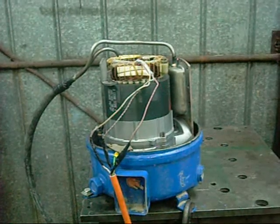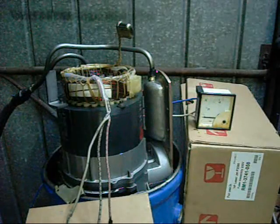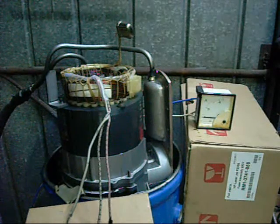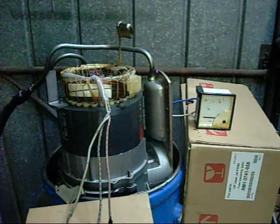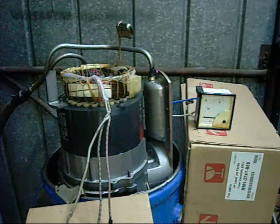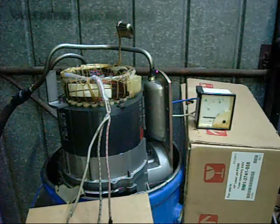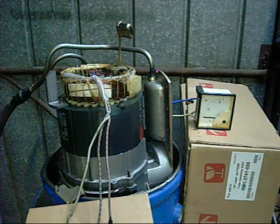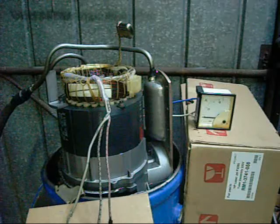Drive won't do it. I don't want to hurt it anymore. Time for a bit of locked rotor fun. I haven't been able to turn it over because it suffered some kind of mechanical failure. I've got a 60 microfarad run capacitor hooked across it. So we'll just see how it goes — it's pretty hot at the moment. I'm not going to give it a chance to cool down. Let's see what happens when it gets really hot.